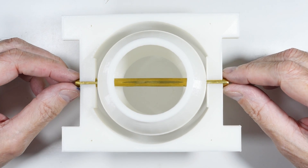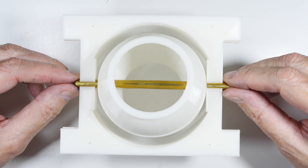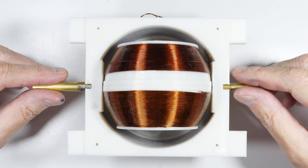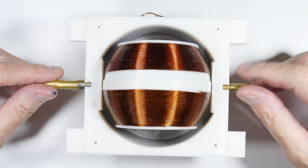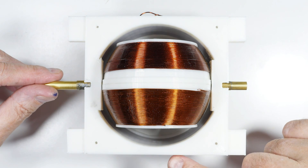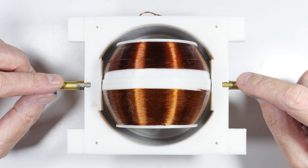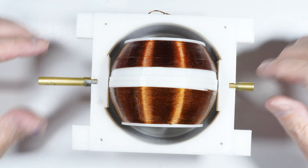We wind the cylinder down here and the ball dips into the windings of the cylinder, either more or less strongly coupling — so yeah, it's a transformer where you can vary the amount of coupling. The ball is one side of a transformer and the other winding is the other side, so the power goes in here, goes through the ball, comes out here. You connect from here to here and done — it's an RF transformer, and of course it rotates.